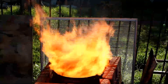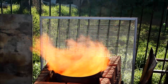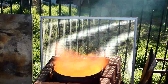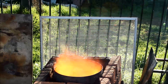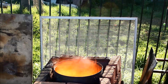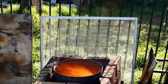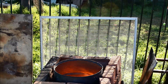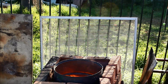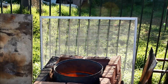I've given it full air now. It will probably burn off a little bit of excess oil pooled in the bottom, and then I'll just throttle it a bit and get the output where I want it. As you can see, it's starting to burn down already, so now I can start the actual fuel control. After you do this a few times, you get to know the settings on your valves and you've got a good idea where to start with. I haven't touched that and, as you can see, it's pretty good — but I can give it a little bit more.